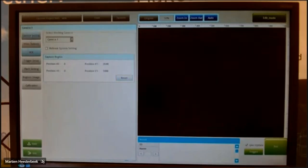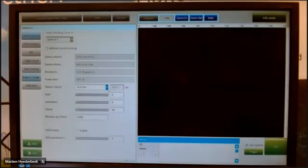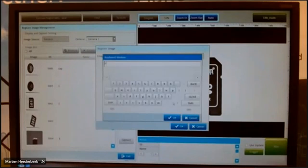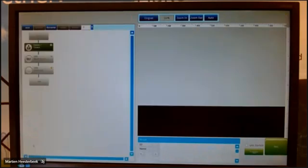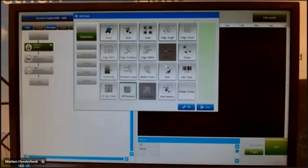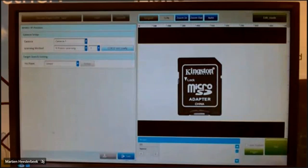Okay. So this is the camera setup. Then I register also this one. I don't know if I have it already. It's there. Now I add the function one pole position. And with this one, I can teach the camera the coordinates of my robot, for example. I will go for a 4-point learning because that is easier.